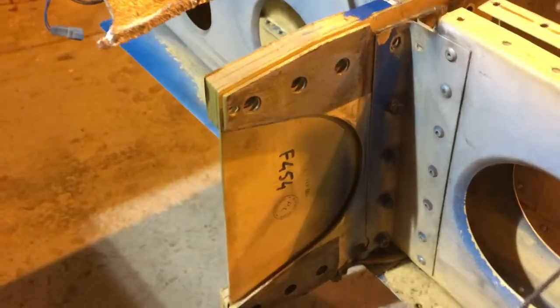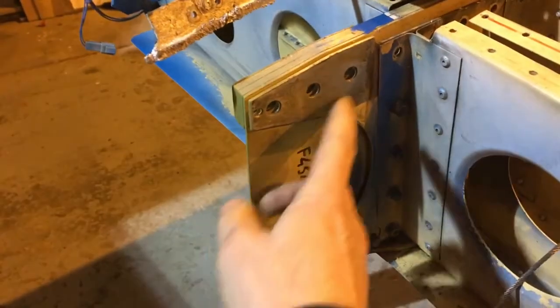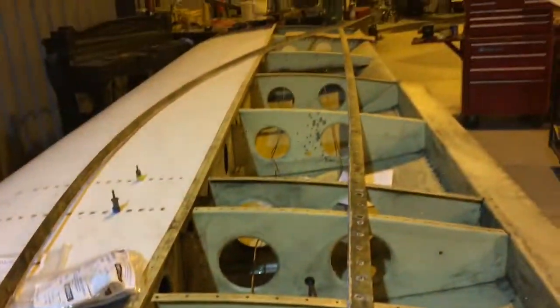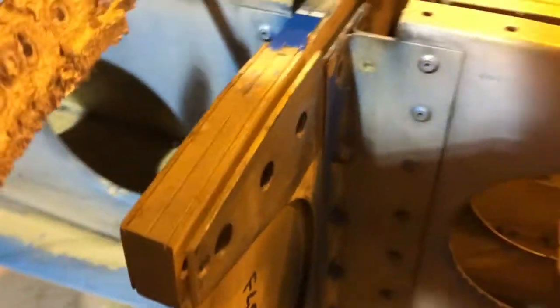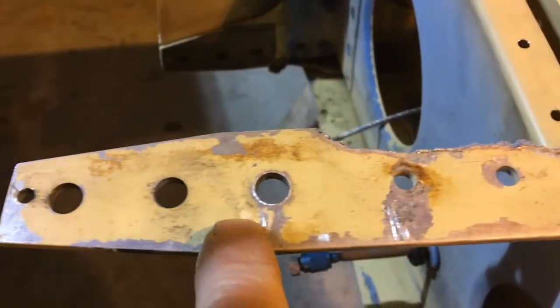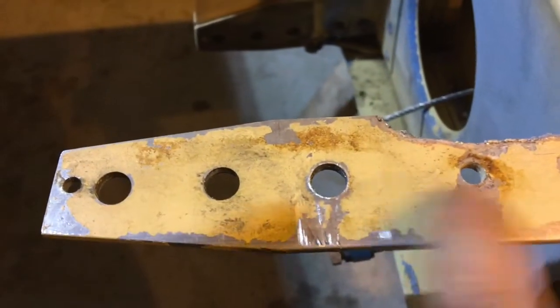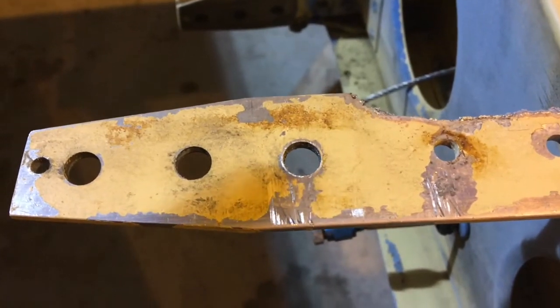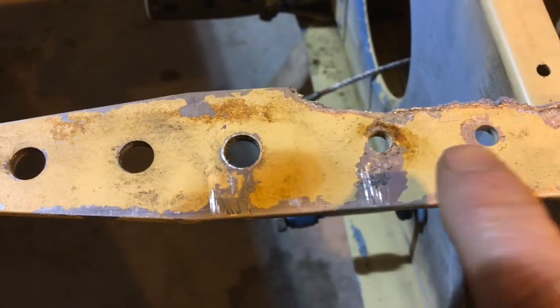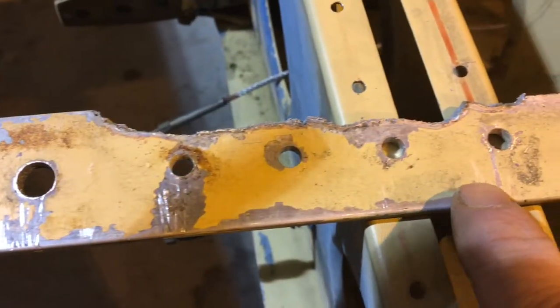What we have here is a section out of a wing spar — a main spar. That's the joint plate where the wing attaches to the fuselage with these six bolts. This section is subject to an inspection every 24 months by taking off the undercarriage and working your way in with little cameras, endoscopes, and bits and pieces.